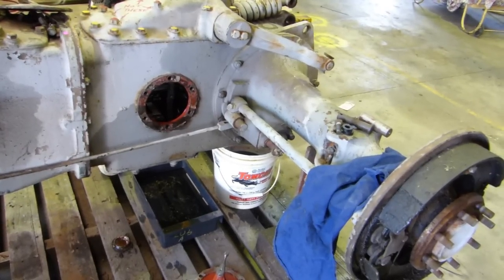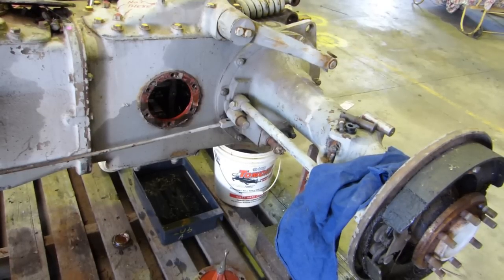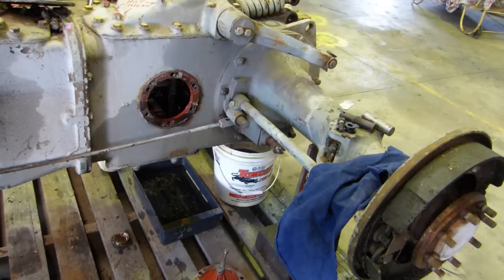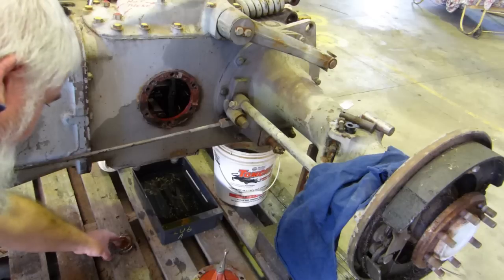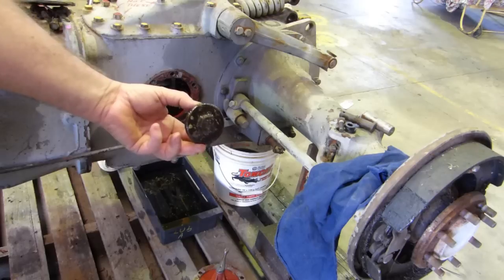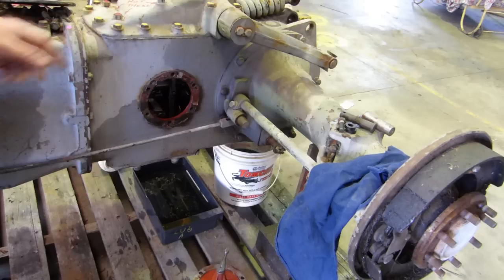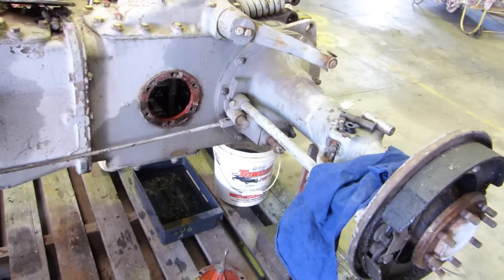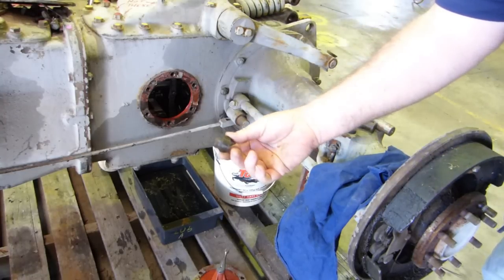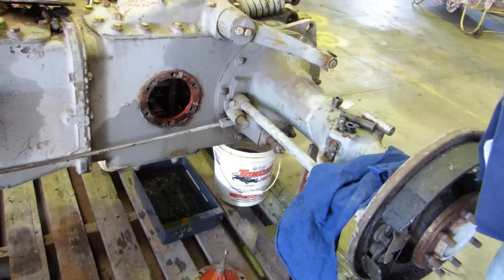This is our 1948 TEA 20 that we're doing up. You can see where I've drained the oil - the square port is straight under the hydraulic pump. This plug here takes a one-and-a-sixteenth spanner. The one at the back is an eleven-sixteenth and it's a small tapered plug. That's number two on the list.